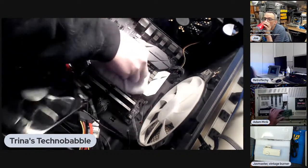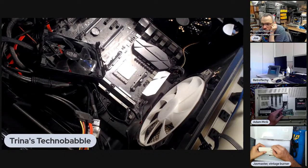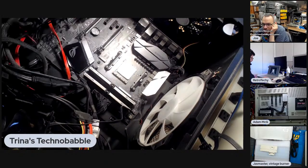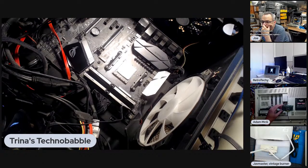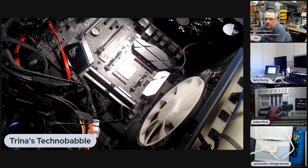Joe, when I bought this Atom, it came with this apparently not common 64K memory card. Ooh, it looks very reproducible. It's probably just like any other thing. It's RAM, a couple of address selection chips like a 74LS138, and probably a couple of buffers like 244s or 245s. It's even cheaper than that. It looks like it's got 8 RAM chips and 2 74 logics, and that's it. There's this winding, I'm not sure what that is, and some resistors and some caps.